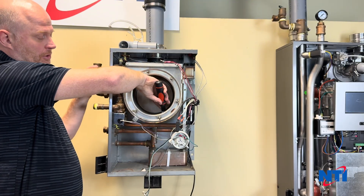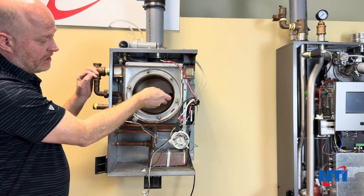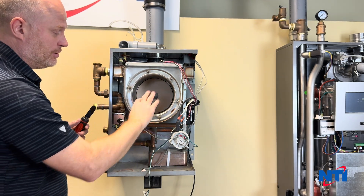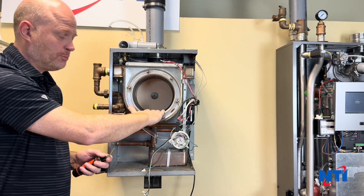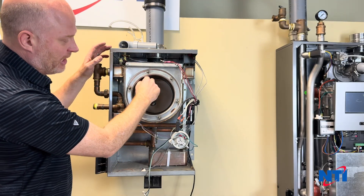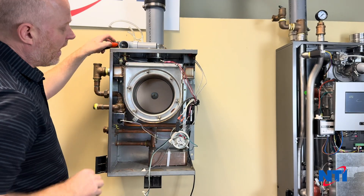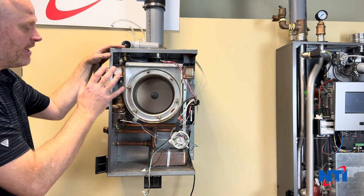Take note of how far in between the tubes you should be able to go — it's about an inch and a half or so in most locations. Make sure all the crunchy dirt is gone. Once you've gone through and done that everywhere, rinse it out again with water. Most of the time a good scrub with a stiff bristle brush and a flush with water is all you need, and the cleaning tool is really just a backup to make sure you did a good job. Test it in four or five locations; if you're not getting a bunch of crunchy debris, you're probably good to go.